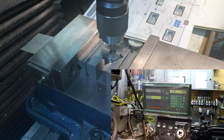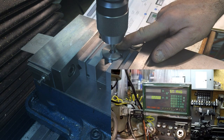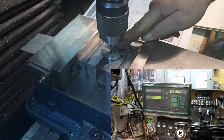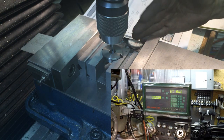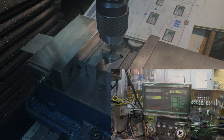Now, I've done this a few times before, and their instructions are a little bit lacking in this area. But you can set your starting angle. What position do you want to start? Well, starting angle off to the right here is 0. Clockwise is a negative angle, counterclockwise is a positive angle. I could start it over here if I wanted to, or over here. I can put in any angle I want. But this is just 4 holes, and let me check something.